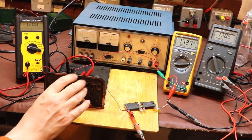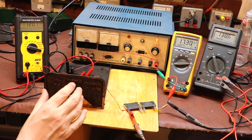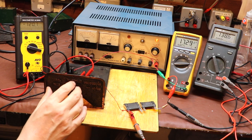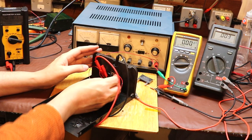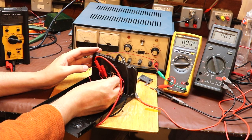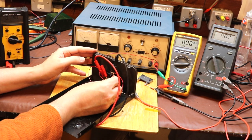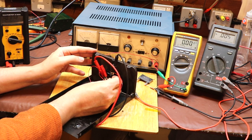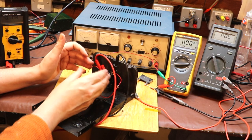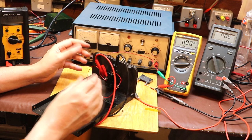Now, just looking at the size of our rheostat, it's physically quite big, and I don't think it would have any problems dissipating that 2 watts of power. Let me just switch off the power. Our rheostat control, I thought it would be warmer than that, but it's actually running pretty cold. Maybe it's heat sinking slightly into the front panel, but I estimate this is somewhere between 30 and 35 degrees. It's not much above body temperature, just slightly warm. So certainly this rheostat had no problems handling the type of loads it was expected to connect to it.